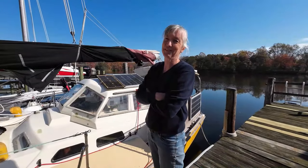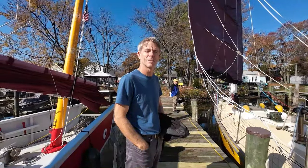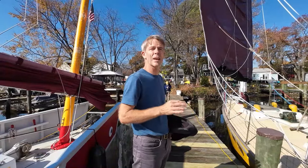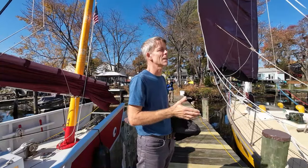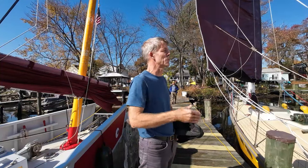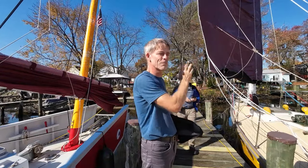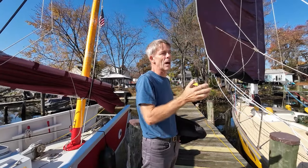Hoisting the sail — you made it look pretty easy. It's pretty easy. So Mike, you've got a lot of experience at this point. Are you happy with the sail? I'm very happy with the junk. We sailed many miles on a cutter rig and a sloop before and they sailed very well. But when we went to this size, our concern was Debbie in particular being able to do all the sail handling alone. With the junk rig, everything is on two or three to one arrangements, so the loads are low. It's all inboard — there's no work on the bowsprit — and it's easily reefed. It's a very easy rig to handle a lot of sail area.